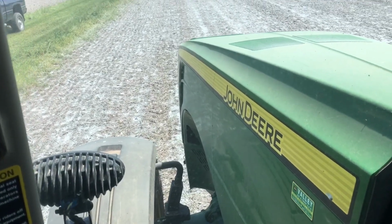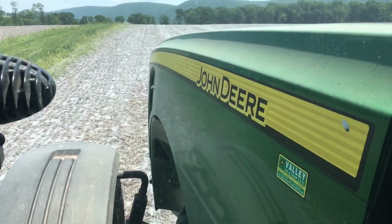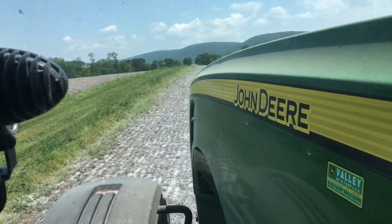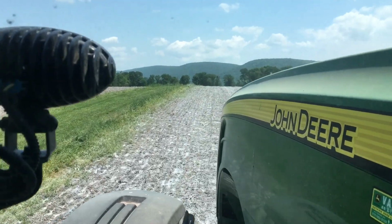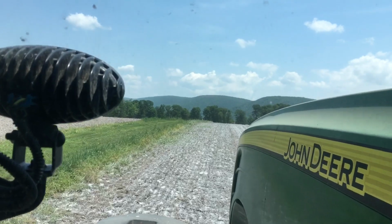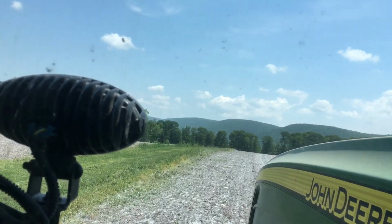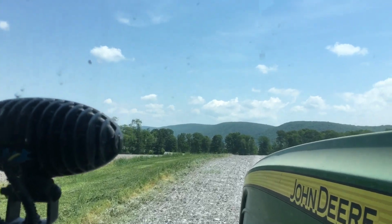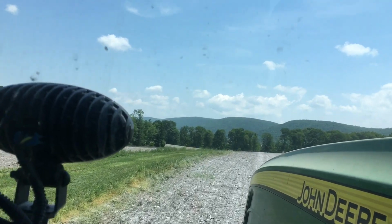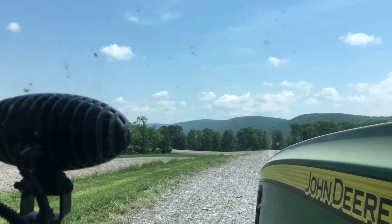The computer that basically paints where you're planting, it kind of paints blue on his monitor. It was painting the width of the planter, just to kind of give you a sense of where you're planting. And there was a real long delay in when that actually started. So it actually made it look like you had skippers all over the field till it actually started working right. So that was another thing.